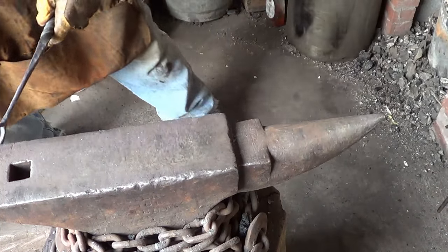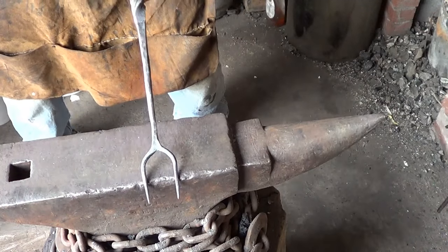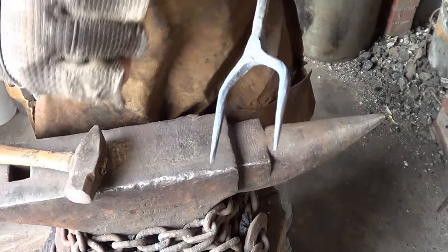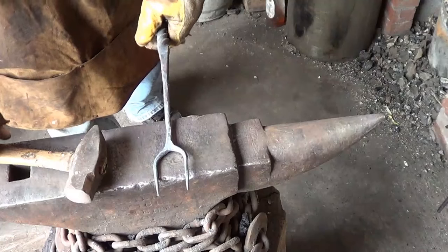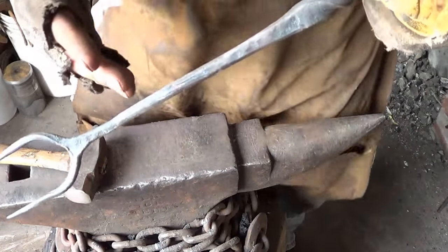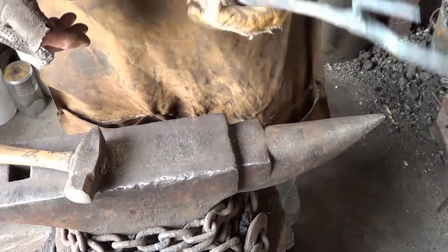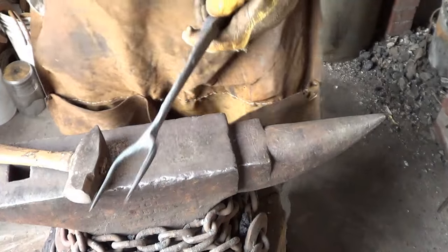Time is money, but quality is money next week - more customers, more repeats. It's got just the right amount of hammering for me. There's a little bit of a fold over there but functionally it's not going to affect anything. Cosmetically it's on the bottom. I think I'm okay with that. We're going to go ahead and put this on the wire wheel, clean up everything from here down. I might hit it with the grinder and I'll run the tines gently on the grinder just to give them a little bit smooth and sharp. Again, that's a fork - it's got to stick into something. I'm happy with the length. I think it's good. Let's finish it up.